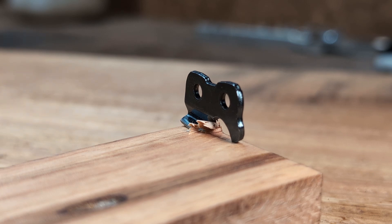The next part of the cutter cycle is it needs to be pulled out of the wood. What gets it out of the wood is chain tension. The chain tension is created by both the static tension you put into the chain when you've tightened it and by the momentum of the chain being turned by the engine. But most importantly, the chain tension that's created to pull this cutter out of the wood is done by the next cutter entering the wood. As the following cutter enters the wood, it creates tension as it's being forced down into it, and that will eventually snap the cutter back into its position.